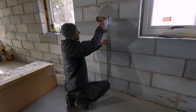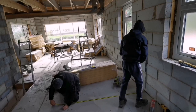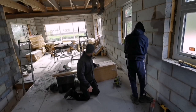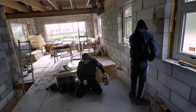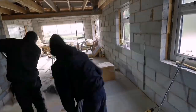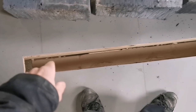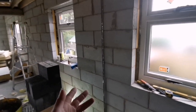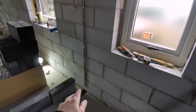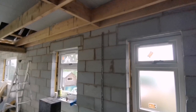I think I'm just going to come in a little bit here to make sure I'm in line, so I'll call it a section on the back of it. Got a nice hole where the blocks are underneath — I've tried them already, they fit, so it's wide enough. Starter ties are up there. What we're going to do is it sinks down a bit, so the bonding is going to be out on the wall, but it doesn't matter because we're using starter ties anyway and it's getting plastered — you're not going to see any of it. So we're just going to starter tie that all the way up.